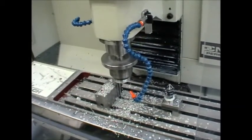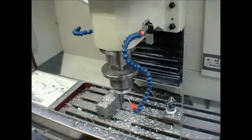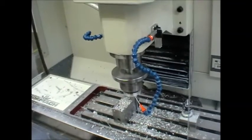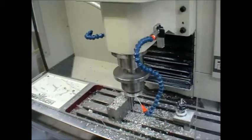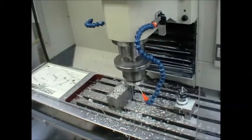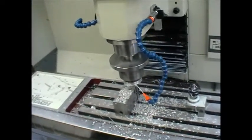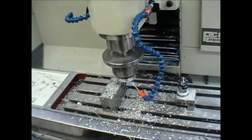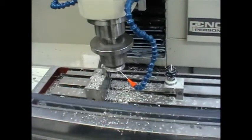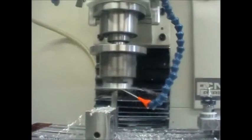The first few passes are just running in fresh air because I may have some blanks that are longer if I just saw them off the ends of bars. The beauty of CNC is that if you can get it to run automatically, it doesn't really matter how long the cycle time is — you can go away and do something else. I've set it very conservatively. You can see the feed rate is quite fast in order to get the chip breaking. In a second you'll see it start to cut, and the next cut will show more because the depth of cut will be greater.